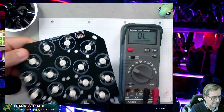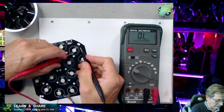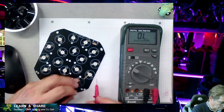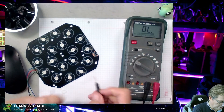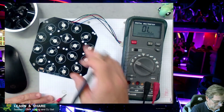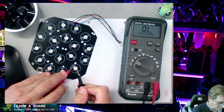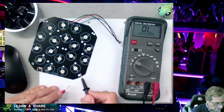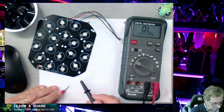The board itself gives us information about the color of each LED. So here's a red — let's see if this red is okay. That one is okay. Here's another red, also okay. This red is also okay. So until now we haven't found any broken ones. But this red does not look okay — we might have a problem on this one. And finally this last red is lighting, so it means they are all connected in series, and only the first three light up. Since that one LED has a problem, that's the reason why the others don't light up.